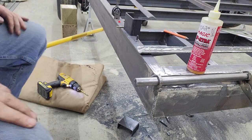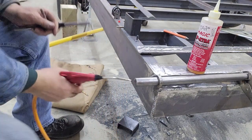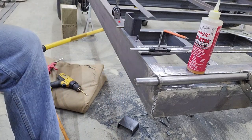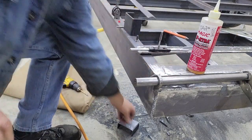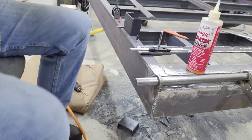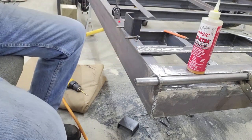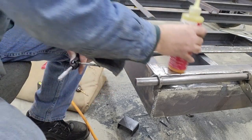I'm going to turn the air compressor on a little bit so I can get some air to blow that hole out. Alright. Got a 5/16 taper tap and a bottoming tap here, so we'll get to the bottom of the hole with the taper tap first.